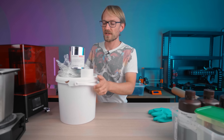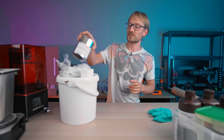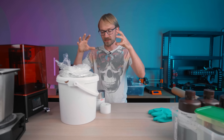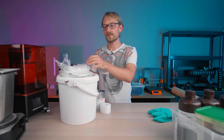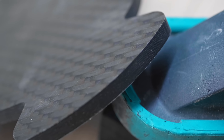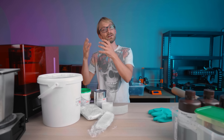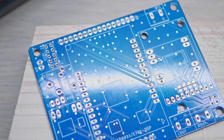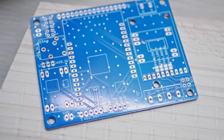Can we add fillers to resins? That is the question of today's video. Now out in the wild, you rarely see just a resin, a cured resin part. Whenever you see a part that involves resin, it's usually because you're using it in a two-part composite where you have fibers for strength and then you're adding resin around there to give it dimensionality and to bond those fibers together.